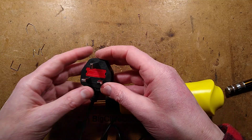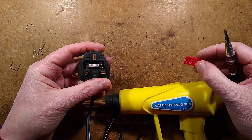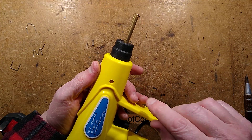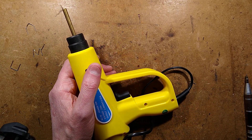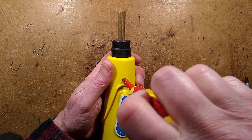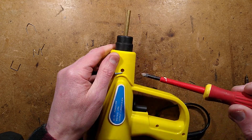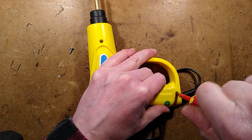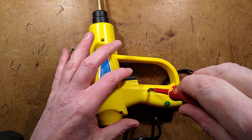I did check — the fuse is in circuit, but it is a 13 amp fuse. Technically speaking, a 3 amp would probably have done this better, but 13 amp it is — it's what they've put in. I suppose we should be lucky they put any sort of fuse in at all. Is this going to reach these screws? No, it's not going to reach the screws. Am I going to have to use my dangerously non-compliant VDE screwdriver that has been cut so they can reach things? Yes, I am. Quality control passed — number 14. Well, we'll actually judge that once we've seen the inside of it. They've passed it on the outside.